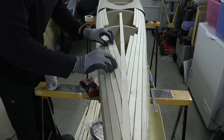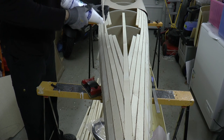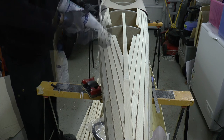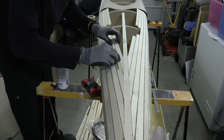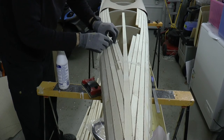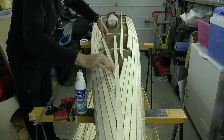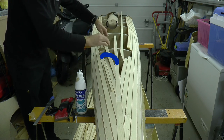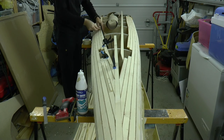Here I have a mismatch in leveling. I add a half strip to have something to sand down into. Another problem is that the whole deck has become too low — I need to add a cross-over strip to adjust it.